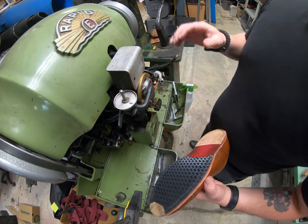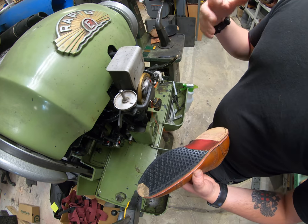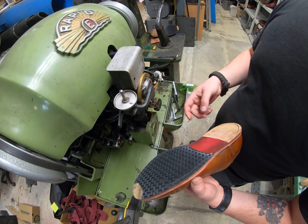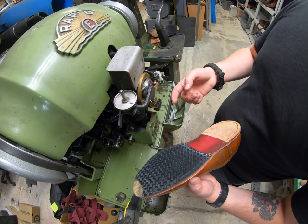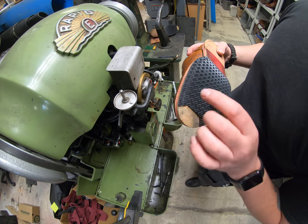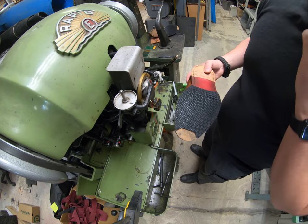Okay, so we're over at our machine. This is what's called an outsole stitcher. It's got a couple of curved needles on it. Well, a curved needle, a curved awl, and a channel knife on it. We've got our channel knife set on the lowest, which is basically nothing because we've got a pre-grooved channel already set in here, so we don't need to deal with that.